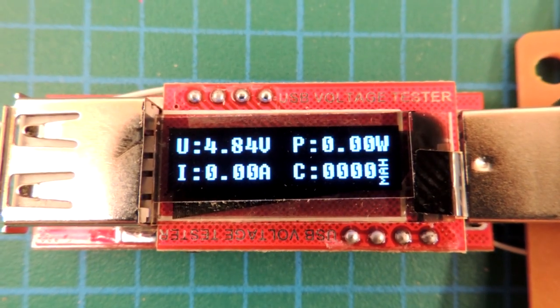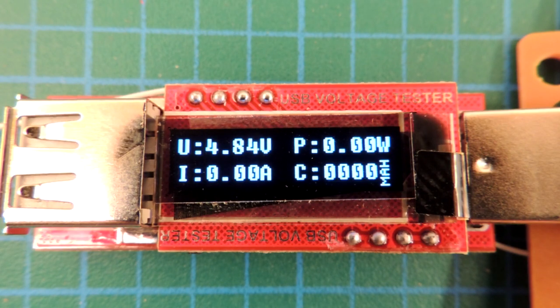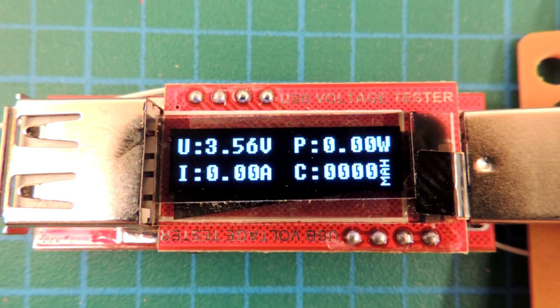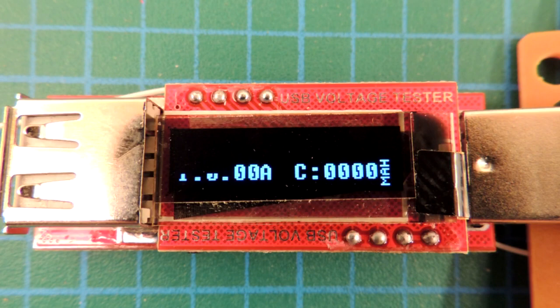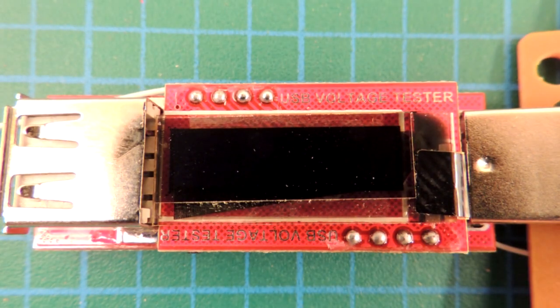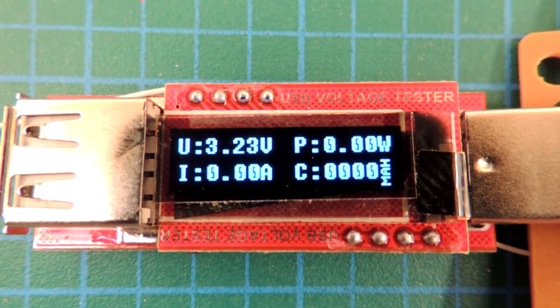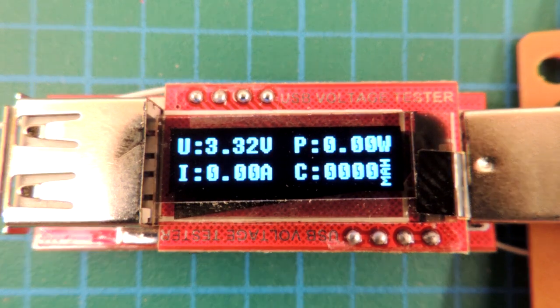This piece of test equipment is self-powered off the USB line. The question is, at what voltage does it no longer function? I've connected the tester to a lab power supply off the frame and I'm just lowering the voltage — we're now about 3.7 volts — and we'll just keep bringing it down until the tester no longer functions, which is around about 3.3 volts. You can see now the poor little microprocessor on the tester is trying to boot; there's not enough voltage so it stays in a reset state. If I bring up the power, it comes back. That's a good wide range — a USB converter should never drop much below about 4.5 volts, so this tester will keep on running in those conditions.